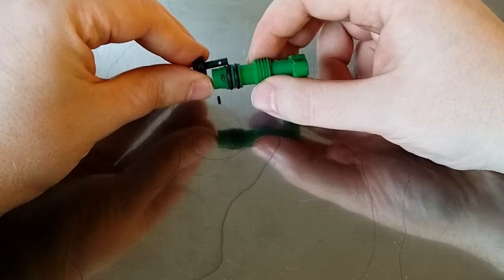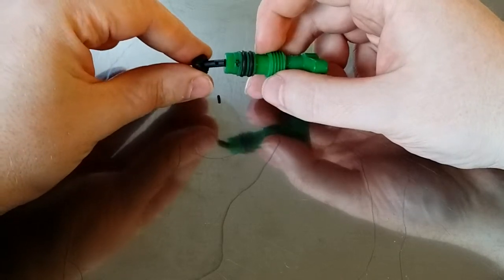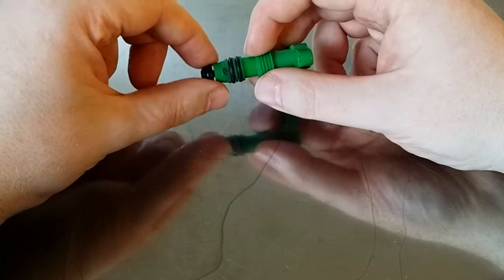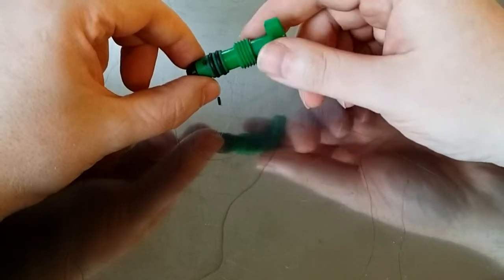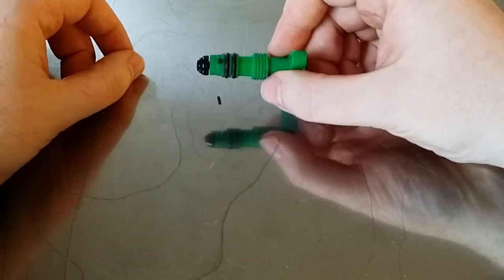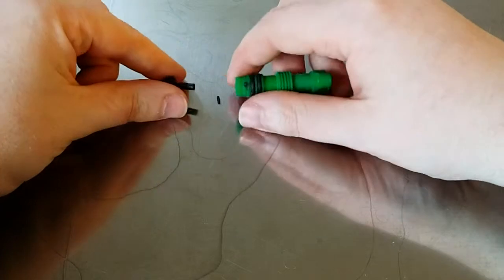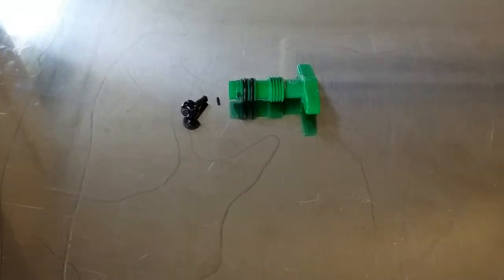That's how they do it. The spring is in there, but this spring doesn't really force out the valve because it's locked in place with that pin. When they filled it up with gas and then screwed in the plunger, it obviously broke the pin. That's how they fill it and then make it non-refillable — by just closing it, then it's non-refillable.